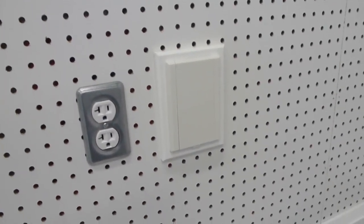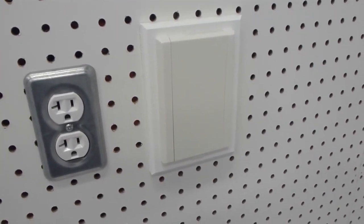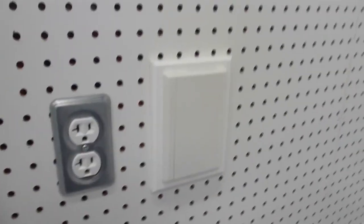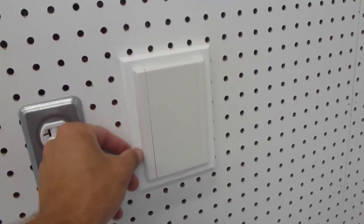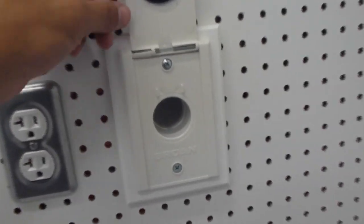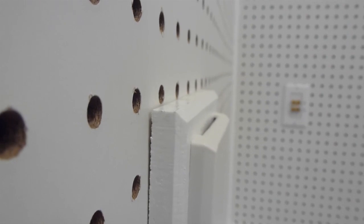And then this vacuum port too. The plate behind the wall is actually for half inch finish board, so half inch drywall. That was sticking out of the wall. So I tried cutting it down with the rotozip and then putting the plate on, but the plate actually still sticks out of the wall. So I had to put this backing board on it first, and then I cut a hole basically. This is just like a frame right around, and then I could put this plate in through it. So now it looks pretty good. It kind of builds it out. Not a bad job there. Just put a bit of a bevel on the side there, and it looks okay.